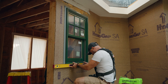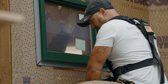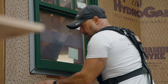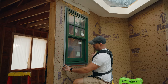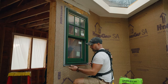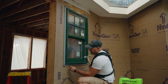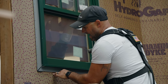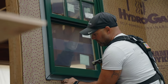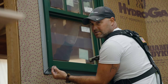Oh, this one's nice — we're actually good on both sides. Typically I would start with the higher side so that when I went to level I could move up the lower side and bring it into level. Now, because we have a copper pan already installed, you need to use copper nails so the metals don't clash. Galvanized roofing nails would corrode the copper and potentially cause a leaky spot.